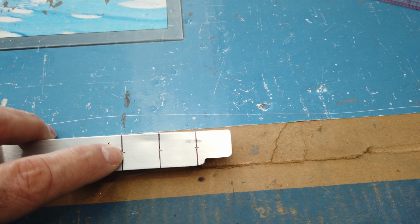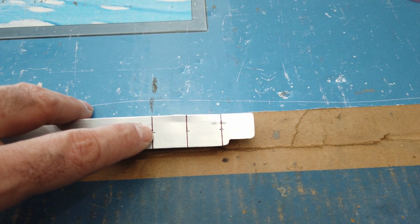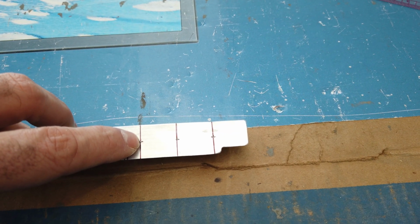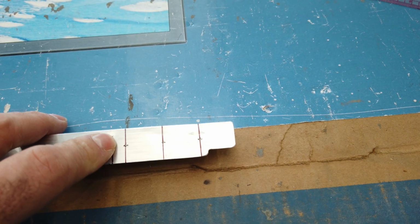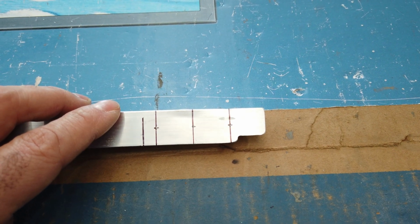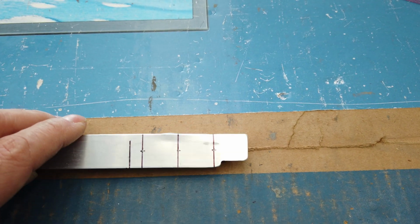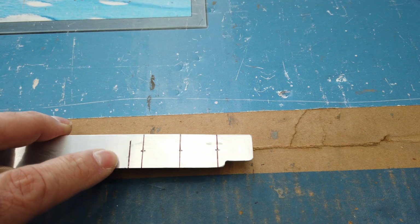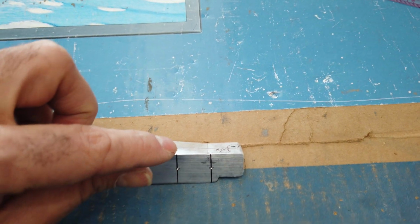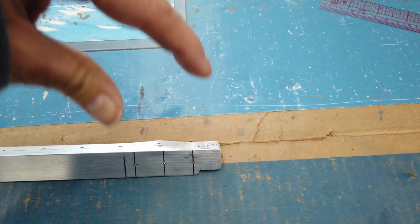And that's it. So now I've already marked the holes. I've already center punched these 3 locations. I'll take it over to the drill press using a very small drill bit. I'll drill these 3 holes and then I'll step them up to these particular ones, like I said, are 1/8 inch. So I'll step these up to a number 30 drill bit. And then at that point, I'll put this back inside the fuselage. I will cleco it and I will clamp it to that heavy metal angle. And then through these 3 holes, using my drill bit, I'll come through these holes with the drill bit and mark these hole locations onto that heavy metal bracket.